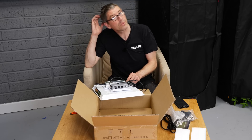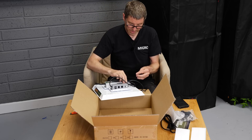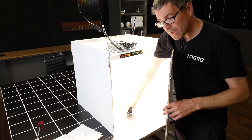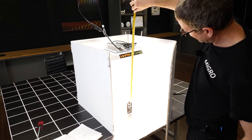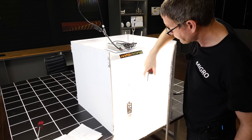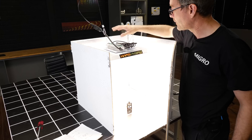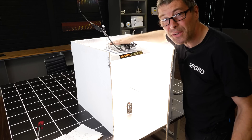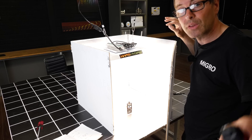We'll get this upstairs to the test area. I'm going to hang it in a two-by-two and do the test. Okay, I've got it set up now in the two-by-two. It is 16 inches — about 40 centimeters — above the sensor. The light is on full power. I'm going to leave it on for about half an hour until it gets up to full temperature, since efficiency reduces just a little when the unit reaches full temperature, and then I'll do the test.